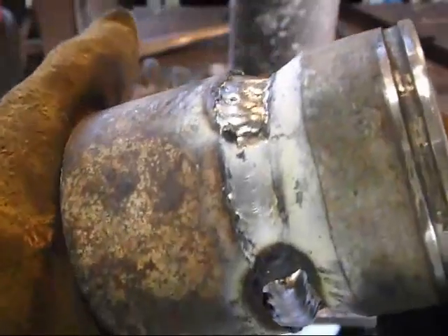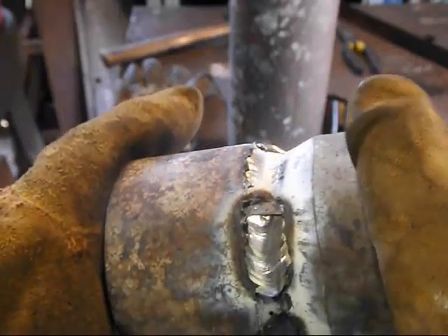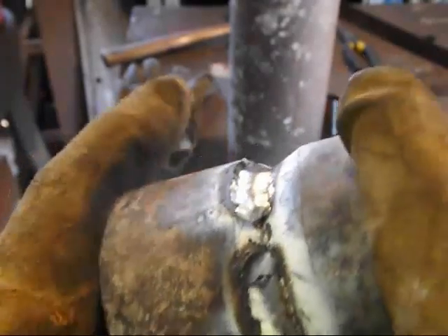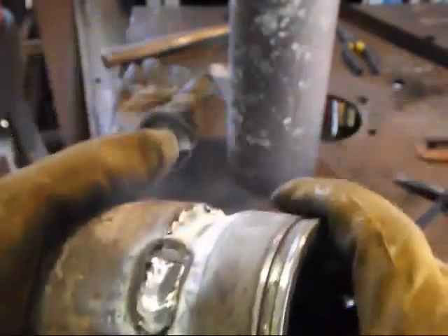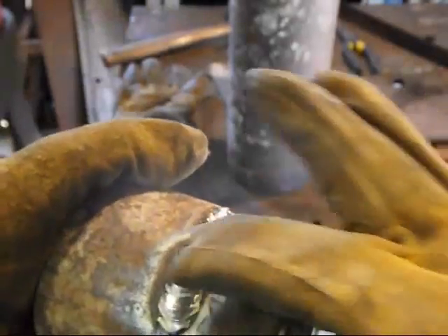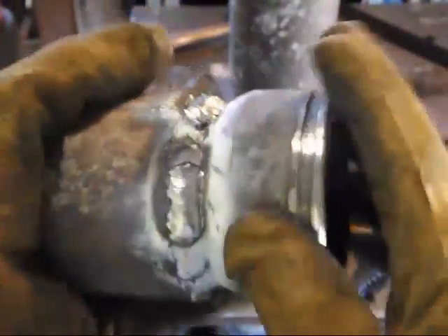I have a little trouble with this rod. I'm trying out a new rod and it really likes to trap the slag. I ended up welding vertical with it. When I first started welding, I'd lay it down and do it on the top — do a flat weld. Then I ended up doing it on the side and welding uphill vertical.